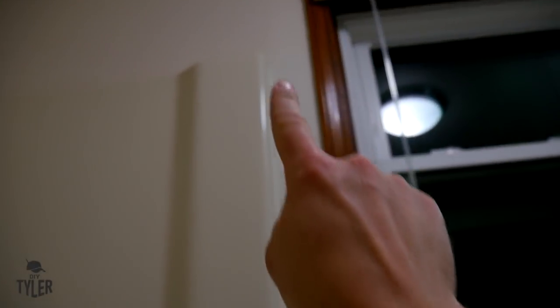We are about to begin removing the tub and the surround. We've got all of the hardware removed as you can see right there, and we are about ready to start hacking this tub apart. The way that tubs and surrounds are attached to the wall is with a flange underneath the sheetrock. I've already investigated, as you can see right here — I wanted to check how far out that flange came into the sheetrock. I'm going to use a level to strike a line all the way up each side of the tub so we're not replacing more drywall than we actually need to once we get all the tile replaced.